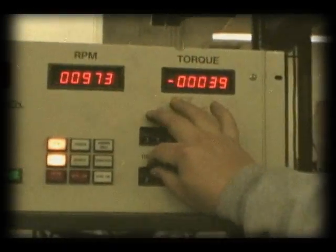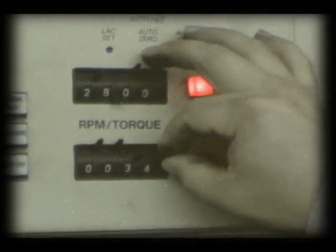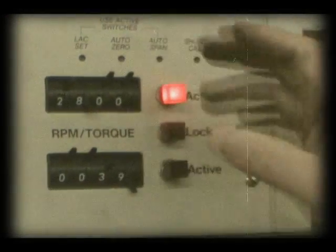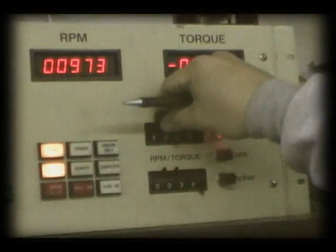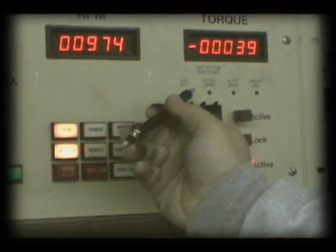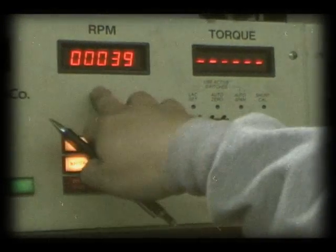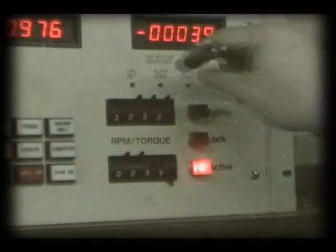Set this up. We're gonna hit everything to zero on this bottom panel, except for the last two digits. We're gonna put those at 39, and then we're gonna take a pencil or a pen and hit the LAC set, and that's not right. You should see 00039 up here. So we're going to hit that on the active and hit LAC set again. There, that's right. Now that we've done that, we can come back up here, set our upper RPM limit,